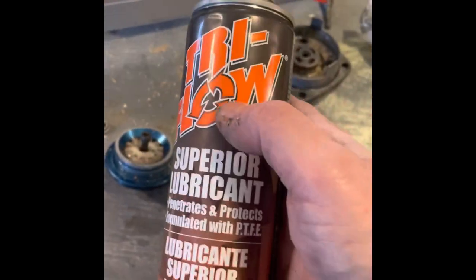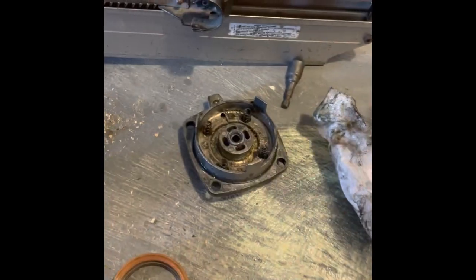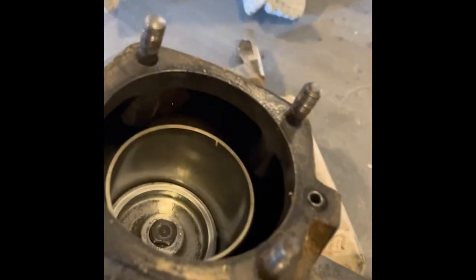And here's the big trick: use a thin oil. This is a sewing machine oil, very commonly used for sewing machines because it doesn't gum. And what I found is when you get into here, the oil is old — it's 30 weight — it gets gummy.